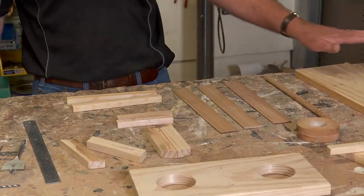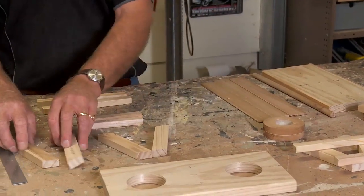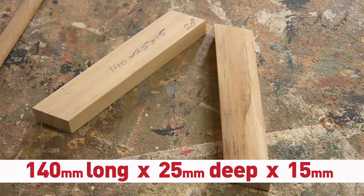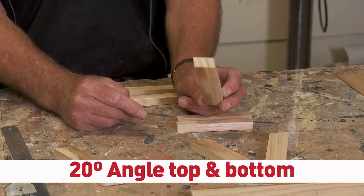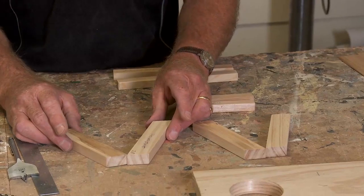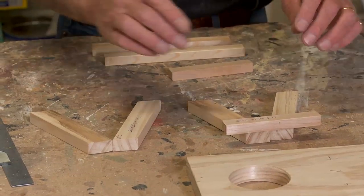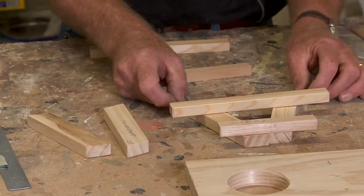These seat pieces are actually the same length as those two, by the way. The legs are made up of these four pieces here — each piece of wood is 140mm long by 25mm deep by 15mm, with a 20-degree angle cut on top and bottom. The idea is that they sit together level there and level there. These two shorter pieces — one goes to the top to support it, the longer piece goes down the bottom, so we end up with an A-frame leg.